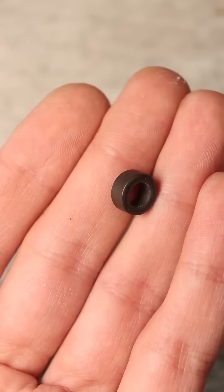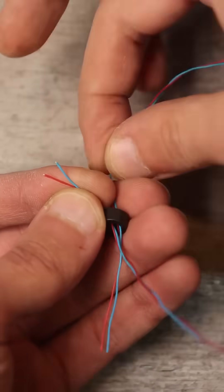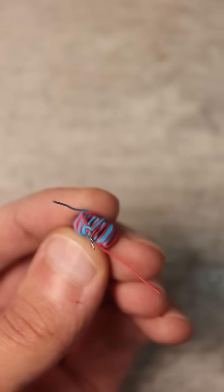From there, take this little ring, then remove all the windings. Take a wire from a twisted pair and immediately wind 20 turns on the ring with two wires. Next, connect the start and end of the windings as shown.